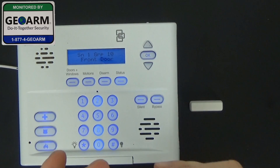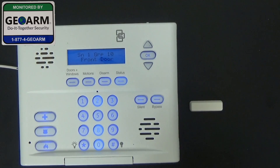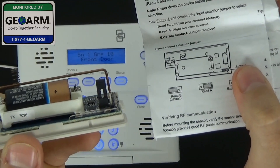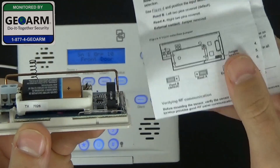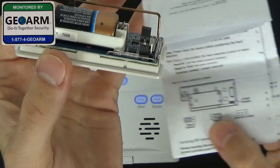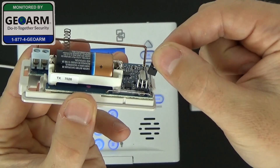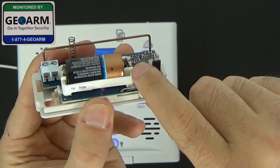As we've seen in previous videos, you want to refer to figure 3. Based on the jumper and where it's supposed to be, right now it looks like it's set up as the default for Reed switch B. We're going to program Reed switch A, which means you want to have the left prong exposed. You take the jumper out — there are three prongs — and move it all the way to the right, exposing only the left prong.